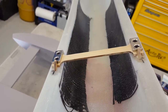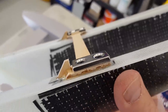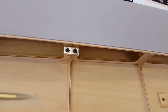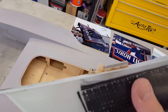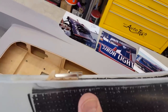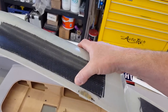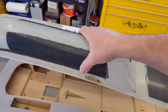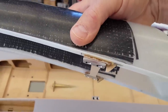So you'll see how I mount them here — just a simple little cross piece and a couple of magnets. But there are little tabs — see that little tab sticking up? That tab fits behind each of the magnets and prevents the cowling from sliding forward and sliding the magnets to a disengagement point. Notice the magnets sit fairly below the cowling and are set below the deck. Magnets will slide apart sideways pretty easily, so if they're up at deck level, the cowling can slide off and you'll lose it.